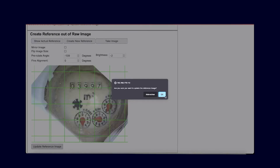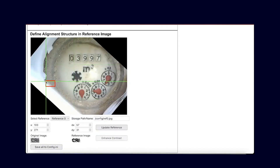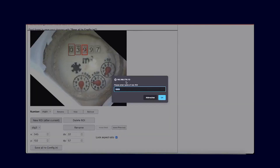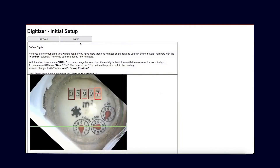Here we need to choose two reference points that are as far apart as possible, so that if something shifts, the AI can automatically recognize how much the image has shifted and automatically adjust your ROI markers. Now we can start with the digital meter — let's go through all the numbers and try to ensure that the inner red circle encloses the number as closely as possible, and that the line in the middle is centered on the number. Only three digits were specified here, so accordingly we need to click on Create New ROI. I named it Digit 4, then adjusted everything again and created a new one. When we have finished, we click Save All to Config, then click Next again.